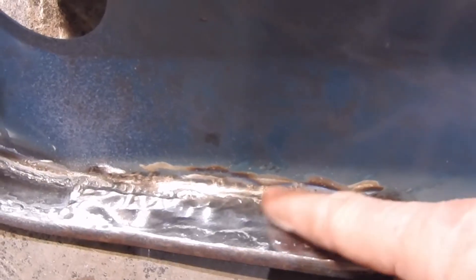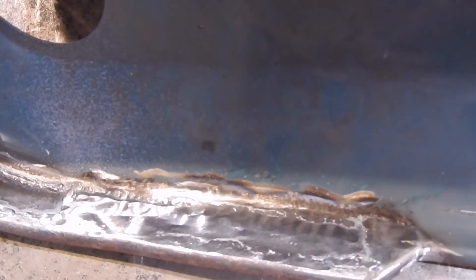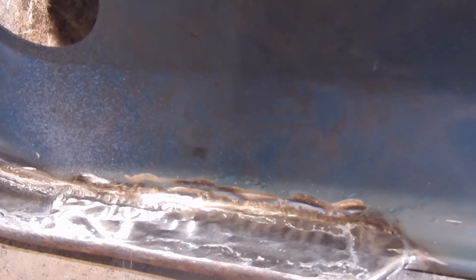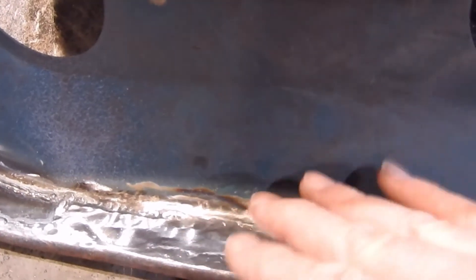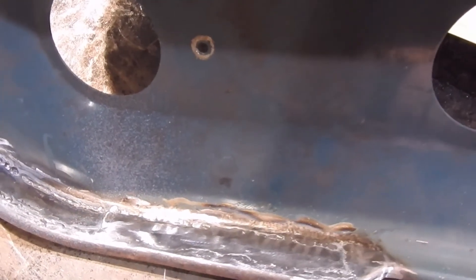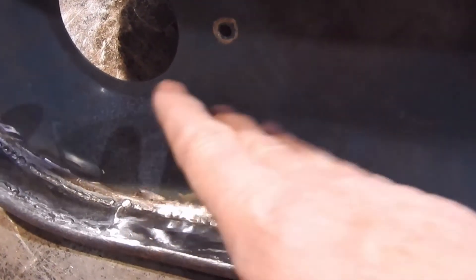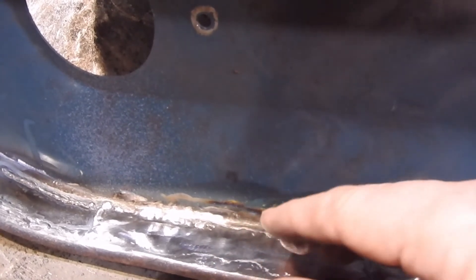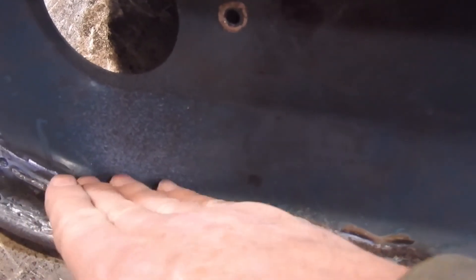I'm doing a little bit of clean-up on the inside here just so that it's not too blobby. I'm not going to worry about getting a mirror-smooth finish - the only person who's going to be looking inside here is me and I know how it's been put together. A couple of tips: firstly, that newly ground surface is hot, so if you stick your finger on it to check how smooth it is there's a good chance you'll burn yourself. Secondly, with whatever method you use - flat disc or whatever - use lighter rather than heavier pressure and move the disc around so you don't burn a hole in one spot, because you'll get a dark mark where it's actually heated up and oxidized the metal, which could well distort it. You're better off with just a gentle action along the seam until you've scrubbed it out to your satisfaction.